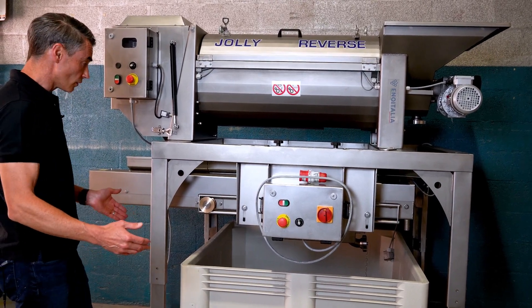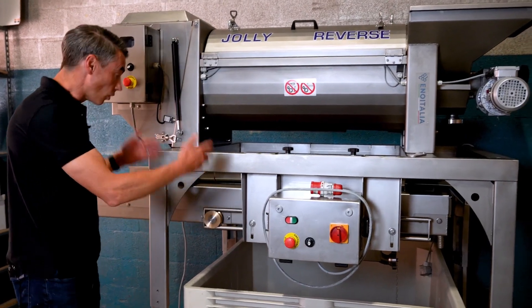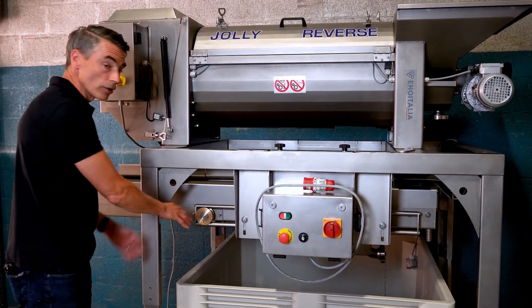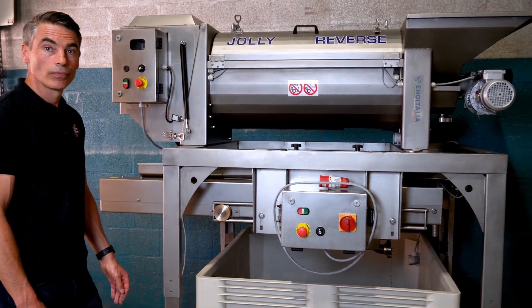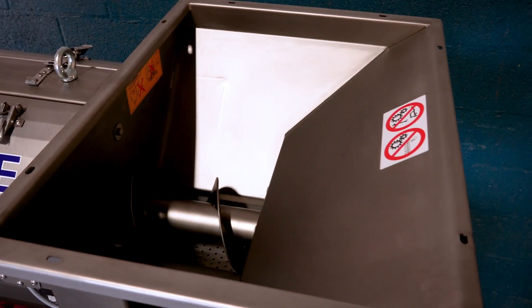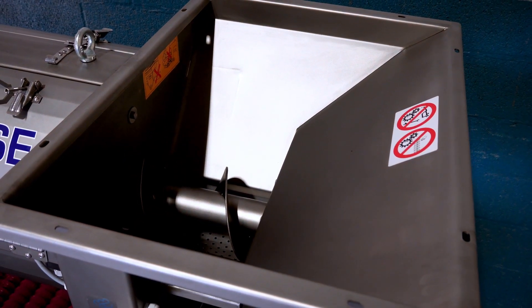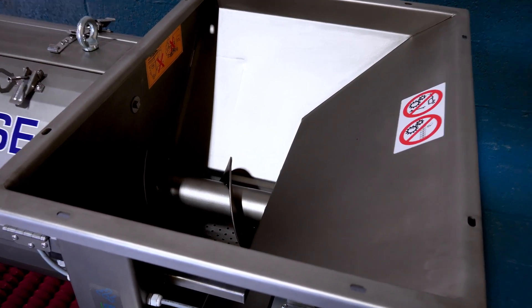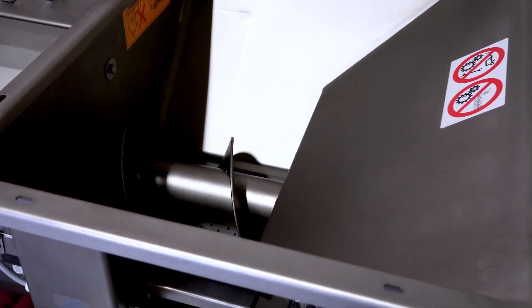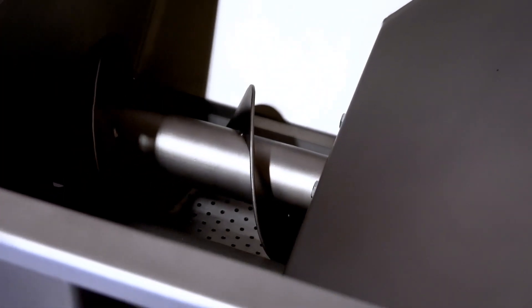The other thing you can do is slide in one of our elliptical receiving hoppers. All the grapes fall down into the receiving hopper and get pumped out through a 3 or 4 inch tube into your fermenter. This is the receiving hopper for the Jolly 60 Reverse. If you're feeding it with small bins this works to hand feed it. There are also larger hopper extensions that we sell so you can feed it with an automated machine or even a bin dumper, as long as you dump slowly enough to feed it consistently.